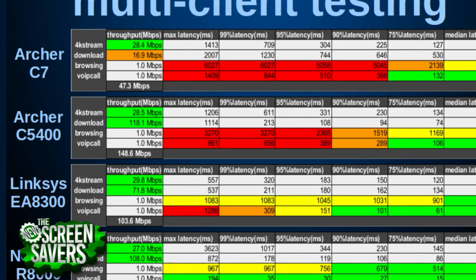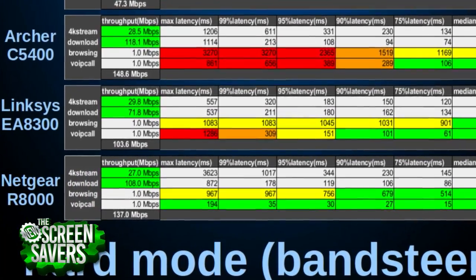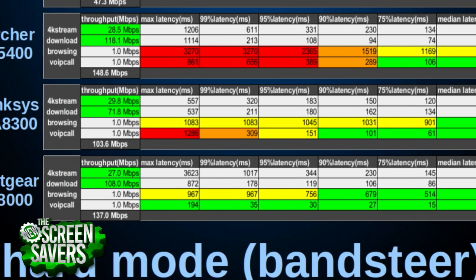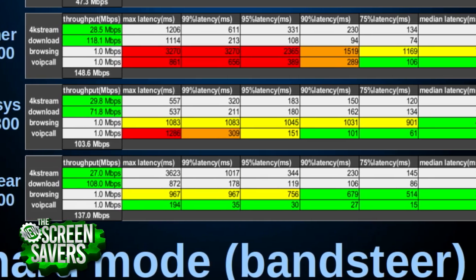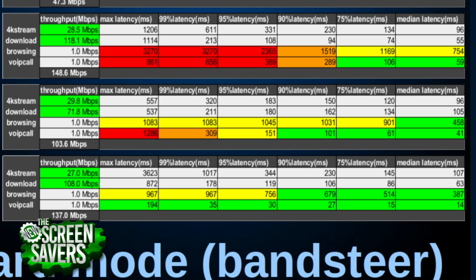And that brings us to the Linksys device. That's the first one in this slide that actually does offer load balancing, but it's not very bright. It doesn't use the 2.4 gigahertz radio at all. This is another tri-band router. It's got 2 5 gig radios, and it only load balances between the 2 of those. And it's not actually load balancing. The documentation says that it picks, and I quote, the strongest signal for any given device.